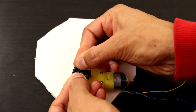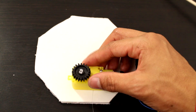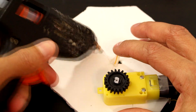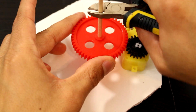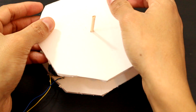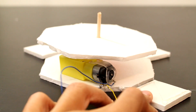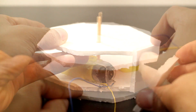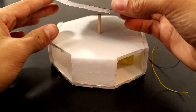Now we're going to start at the base. The base is going to be powered by this little electric motor that I got — I'll leave a link in the description below. I'm going to stick a small piece of straw and glue it into the base; this is going to be used as something to rotate our gear inside of. I cut the gear down to size and put a lid on top of it. Next we're going to build the sides and glue them on there, which should secure the gear into place so it'll always mesh with the motor.